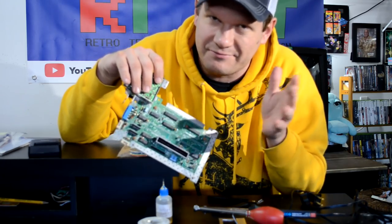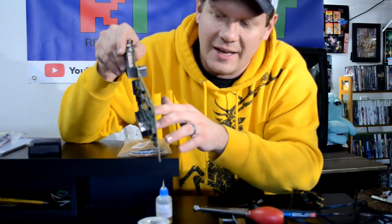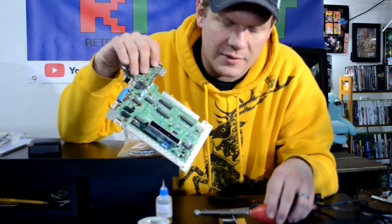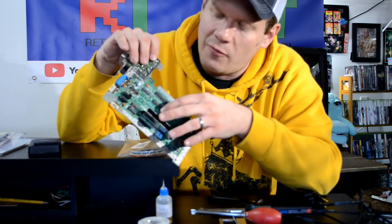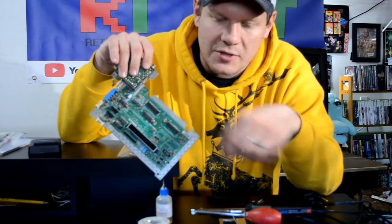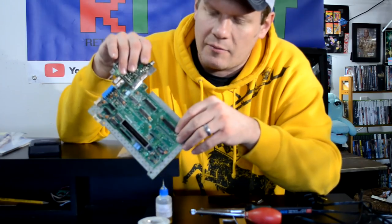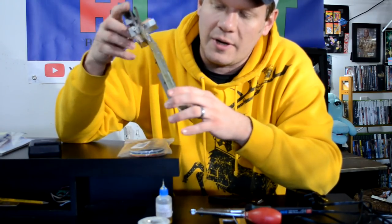I said for most smaller mods, but when you have more tiny things to pull like these pins, it's very tricky. I had to use this pump and go over some of these spots 3 and 4 times, and I even had to add fresh solder on a couple spots and re-suck them. But I just wanted to show you that it is possible, but it is very difficult.